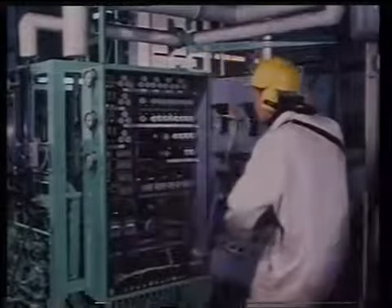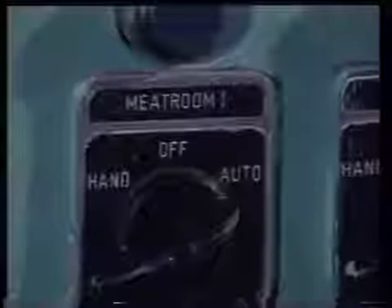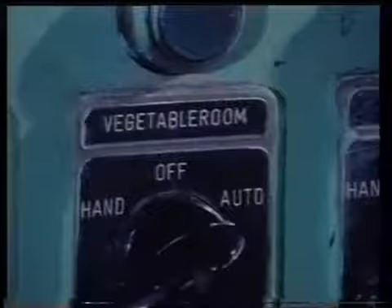Now let's look at some ancillary circuitry such as the refrigerating plant, alarms, and emergency stop buttons. The refrigerating plant for the meat room, the flour room, and the vegetable room is controlled via a common panel. This panel houses the relevant direct online starters which connect the appropriate motors to the supply when activated by a thermostat. In case of malfunction, check the thermostat and the solenoid valves for correct function — these sometimes get stuck in a closed or open position.